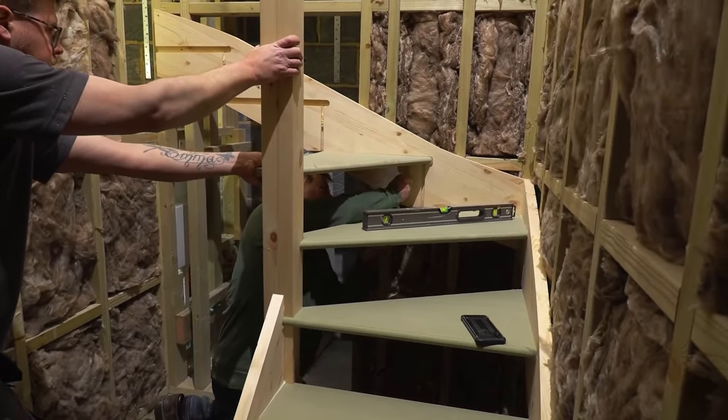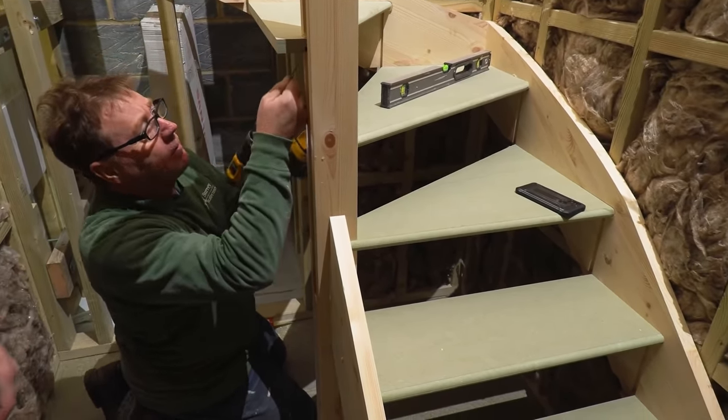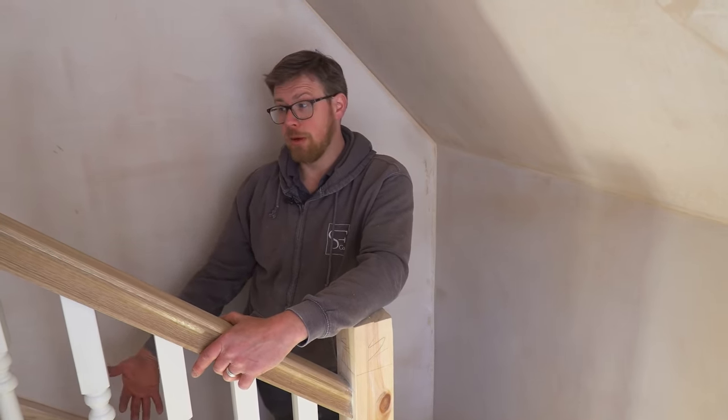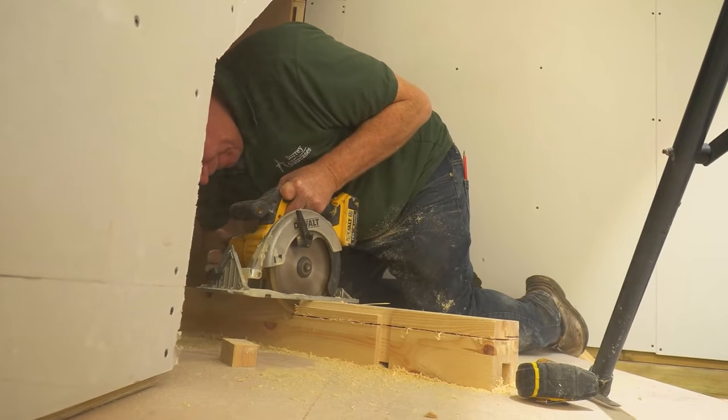And also you've got to remove the plasterboard backing off the staircase, or in this case fireboard off the back. Fortunately, it's highly unlikely to be left open nowadays, because of fire regulations, especially on a loft conversion, it's got to be boarded with fireboard. And even downstairs, they're asking for sound insulation underneath staircases as well. So it's going to be a pain getting all that backing off just to tighten the wedges up. So I quite like that we don't have wedges.